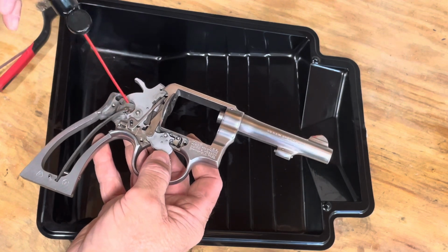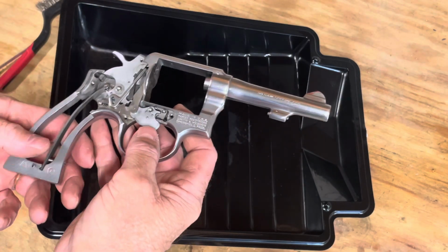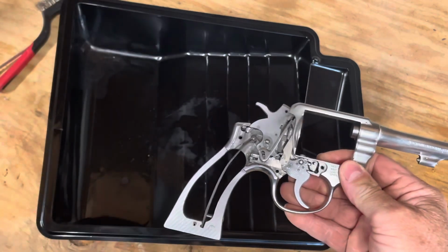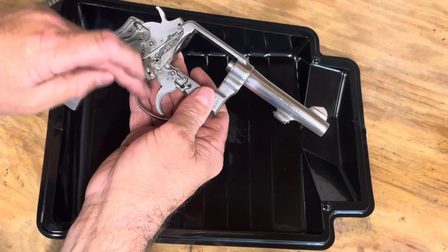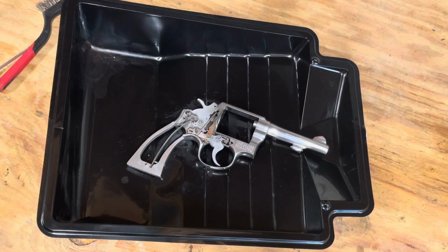What I'm planning on doing, I'm going to run it a little bit, and I may give it the old 1960s, 1970s trigger job afterwards, if anybody remembers those days. It was pretty common to give a Smith & Wesson revolver a polish job, basically by removing all the lube and gunk and filling all the nooks and crannies and covering all the little bearing surfaces with plain old gritty white toothpaste. Close it up and run it, and run it, and run it, and it would act like an incredibly fine abrasive and give you some really glass smooth results.